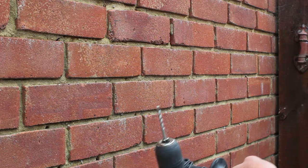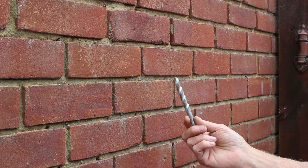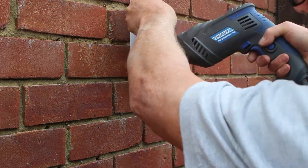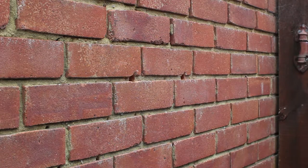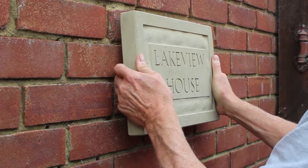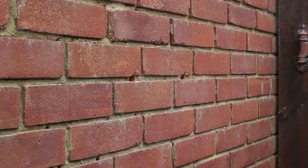I'm going to drill the wall first using a small pilot drill — about a quarter-inch pilot drill — and then enlarge the holes to 15mm using a bigger drill bit. I'll put this on mute so you don't have to hear it. Once the holes are drilled, we offer up the stone sign and line it up. It's binding slightly on the left-hand pin, so we need to use the drill just to ream out one of the holes a little.